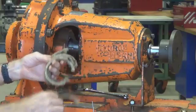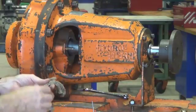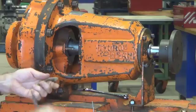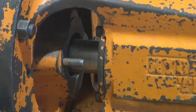It's important to count the number of strands that we've got. In this case we've got 7 out of that pump. That means at least 7 new pieces, and 1 more probably, just to keep the gland back from the stuffing box and allow some periodic adjustment on it.